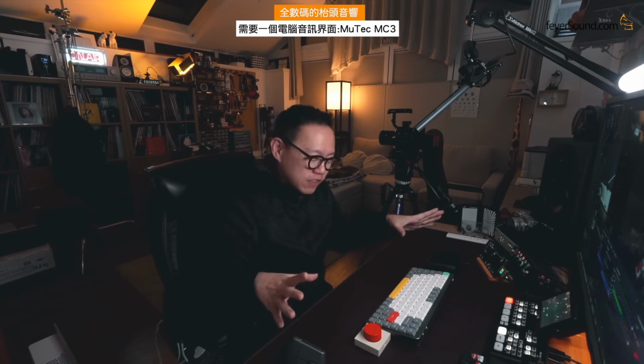Alright, so the digital input for the speaker is AES3. AES3 only supports PCM, up to 24-bit, 192 kHz. For hi-fi enthusiasts, they might say, hey, I wanted to handle 768 kHz, 32-bit, or DSD up to 512, and so on. But actually, in the world of production and recording, the specs do not need to keep changing. For me, in this context, I really do not need the specs to keep changing.